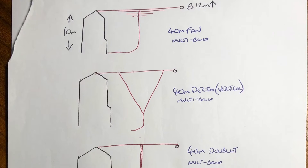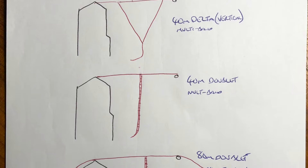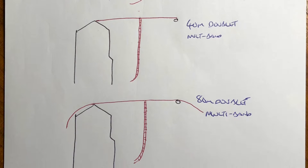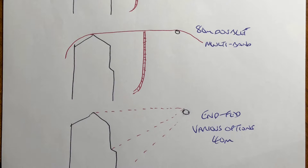The reason for building a balun is I'm contemplating possibly a fan dipole, a dipole or a doublet. So I need a one-to-one balun choke, and I could expand the design in this video to be a four-to-one as well.